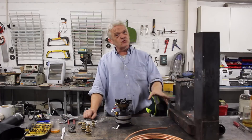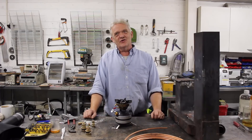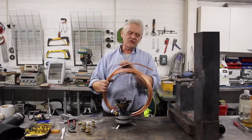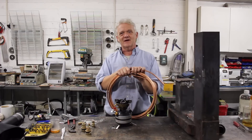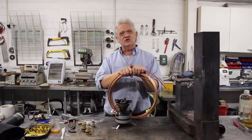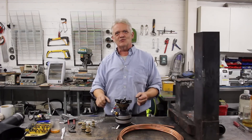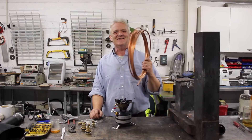These things get up to some temperature. Even just on wood burning, this will get to five or six hundred degrees centigrade no problem at all. If we're adding a jet of fuel, we can expect hundreds of degrees, so we want something robust in there. I've got this, which is micro-bore copper pipe — eight mil copper pipe. It's meant to be bent, so it bends over a fairly slack radius quite nicely. Over a tight radius you're better filling it with dry sand and bending it on a former. We're going to use this — it may not stand up to the temperatures but it will show the proof of principle. We'll form a preheater coil with a hole in the end of the pipe to jet the fuel out, pop it in here, use a fire to preheat it. So let's fill this with sand and get bending.